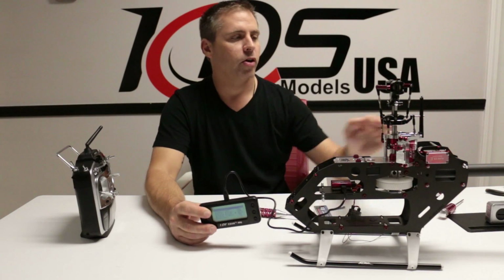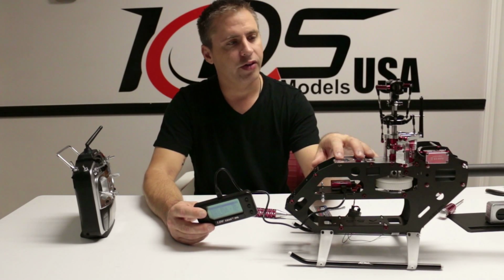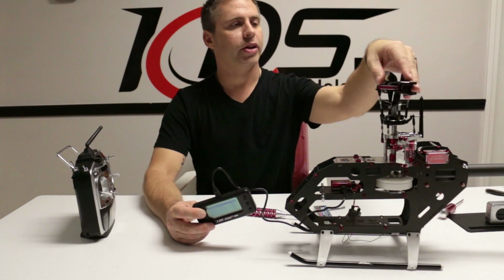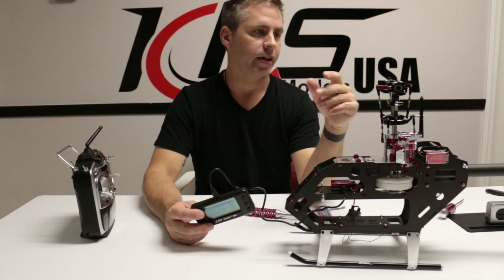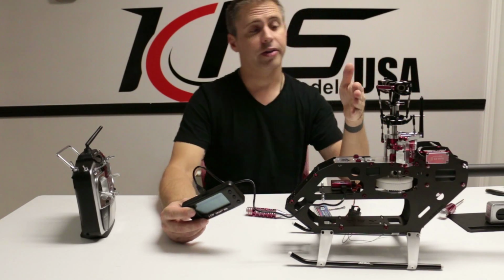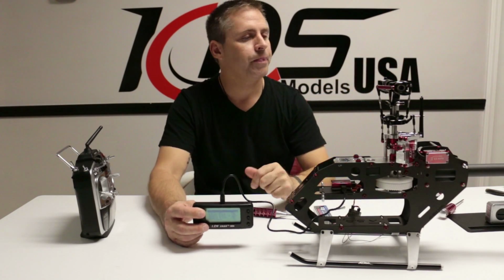Normally, I make sure that my helicopter is mounted securely where it's not moving around. I use a nice level surface on the helicopter to zero the pitch gauge, and then check pitch with the blades perpendicular to the helicopter. I always check it on one side, rotate the head, and check it again on the same side, and I normally calibrate my pitch gauge multiple times throughout this just to make sure that it's working right. Take care to make sure that your blades or your head is perpendicular to the helicopter. Offset by a few degrees can make a difference in pitch settings. So we should get this set to 0 now.